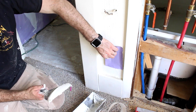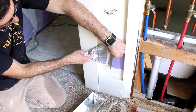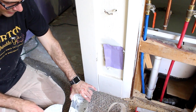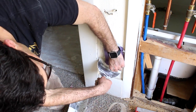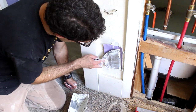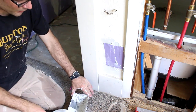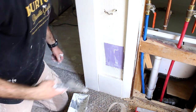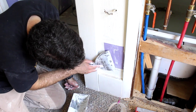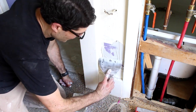You're not going to need a ton of joint compound. I would almost have applied the joint compound before putting the patch in there. You may need a smaller knife, or here's what you can do: you can apply the compound to the back of the paper and then smooth it into place. In this case it's such a tight little area, but you could place the joint compound on the wall no problem. It also looks like somebody may have tried to patch something here before, but you definitely want this to get embedded as best you can.